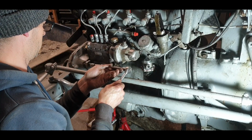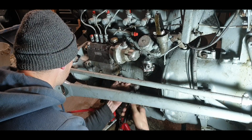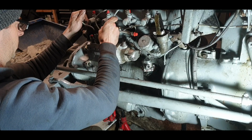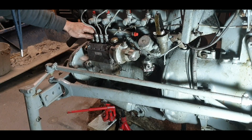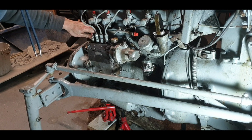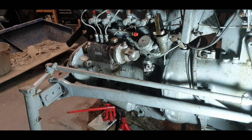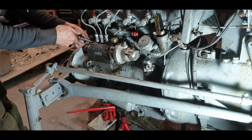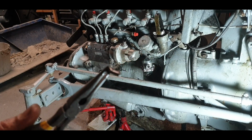That's it. Grip under there nicely. Okay, we'll see how to twist the pump. Yeah, we are. Okay, so now we just take out this delivery valve. Be super careful of keeping this clean. This makes a very important connection. So we have a spring there as well. The spring is in that. So we'll get our snouty pliers. I have a container got for this already. So that is our delivery valve.